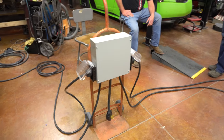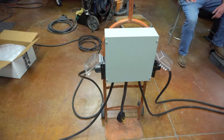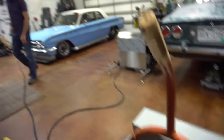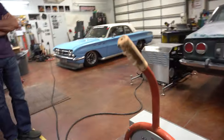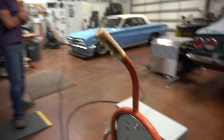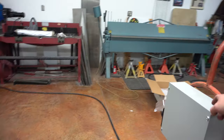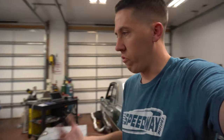Pretty neat deal that we came up with to make this thing semi-portable — it'll work in multiple places. Big shout-out to my dad and Bud for building that and coming up with quite a neat unit to help power this thing. Something really cool on here is we have this power switch — it's essentially just going to kill power. Instead of having to go over and unplug it out of the building, you can just flip this and it trips a contact inside and kills power to the unit. It's kind of like a safety switch too — if something goes weird, all you've got to do is reach back here and pop this and it'll turn off. There are fuses in here as well, just in case of a voltage spike — a little bit of safety built in as well as making it more universal to use.